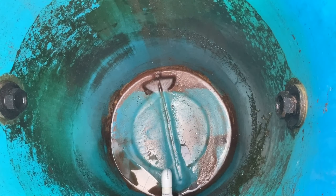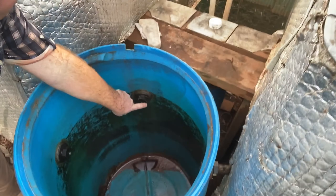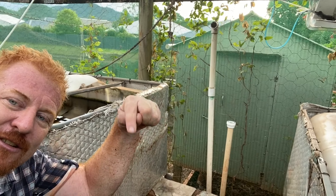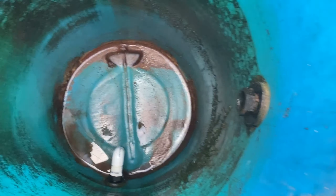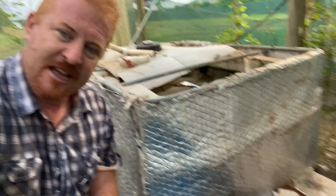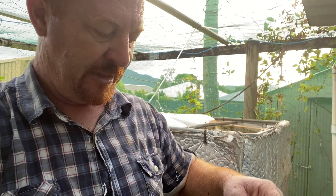I'm putting another barrel union on that second pipe too. With the shade cloth out you can see the inlet coming in at the back, the higher pipe going straight down through the middle, and two outlets on the side that overflow into the tanks beside me — normally with aquarium fish in them. There's a little tap at the bottom that lets me drain the junk out; it sucks right from the bottom, which is very handy.